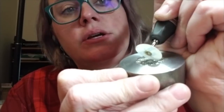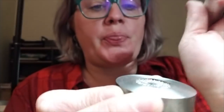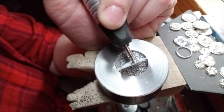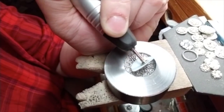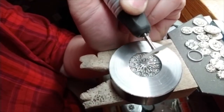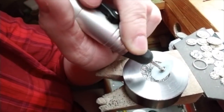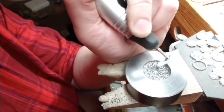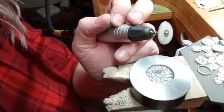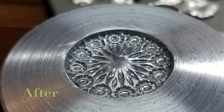To get rid of these concentric rings, you can just go straight in here — you can see how the disc flexes to kind of fit into the center of the die. I'm just very lightly working over the surface of the center; I'm not bearing down. I'll just slowly work over it until those concentric rings disappear — it's not going to take very long. I believe these are fine sanding discs, seven-eighths of an inch wide.